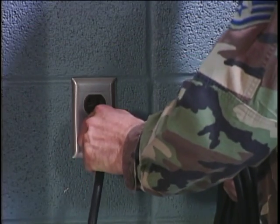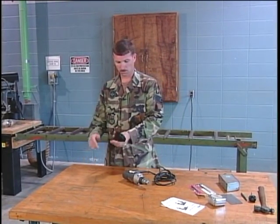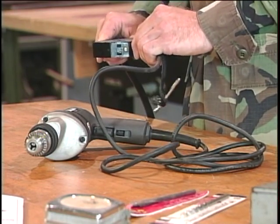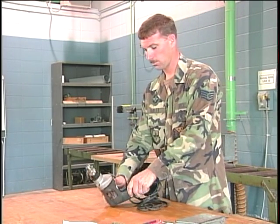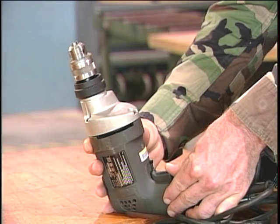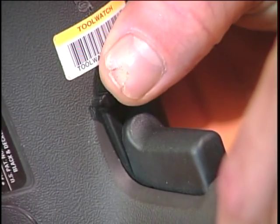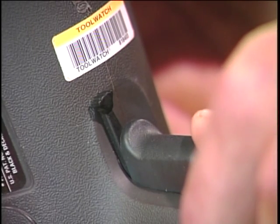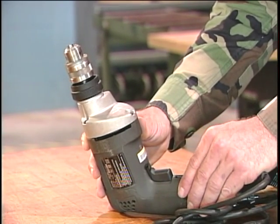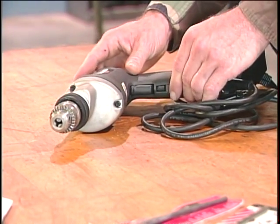It's a good idea to test the drill before you leave the shop. You don't want to arrive at the job site and find out your drill won't work. Squeeze the trigger switch, and the drill should rotate either clockwise or counterclockwise. The direction the drill rotates is controlled by a selector switch that is located next to the trigger switch. This selector switch is commonly called the reversible switch. Move the switch to the normal operating position to force the drill to turn in a clockwise direction for drilling